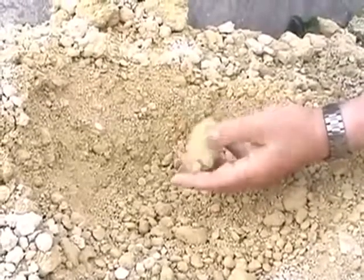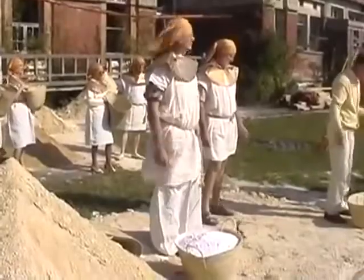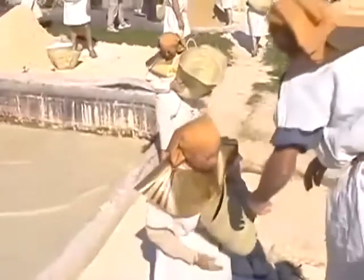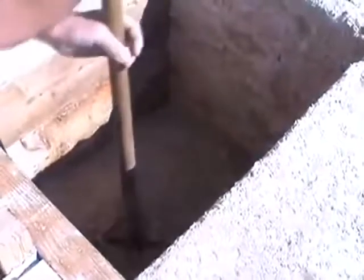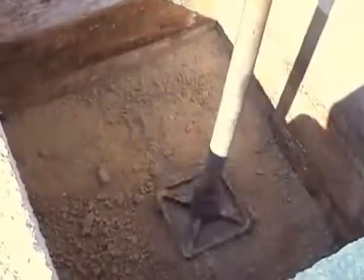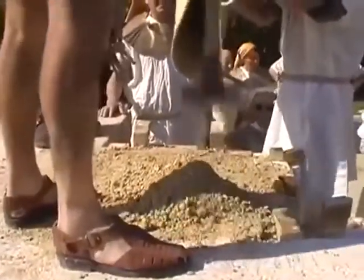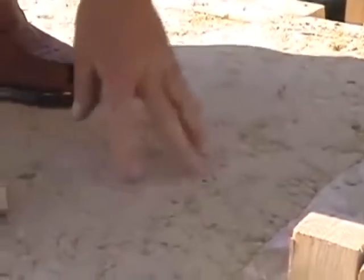This batch will quickly gain strength. We do all of the work manually, forming a human chain, carrying buckets from the mixing area to the mold. We pour the limestone-concrete mixture in a mold and pack it down with a tool called a rammer. Compacting the material requires little effort. The packing operation encourages cohesion, and the denser mixture takes on high strength from the initial curing phase.